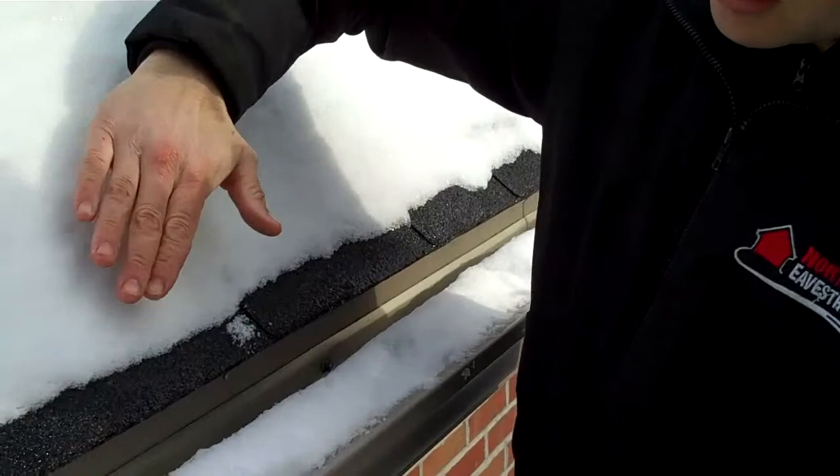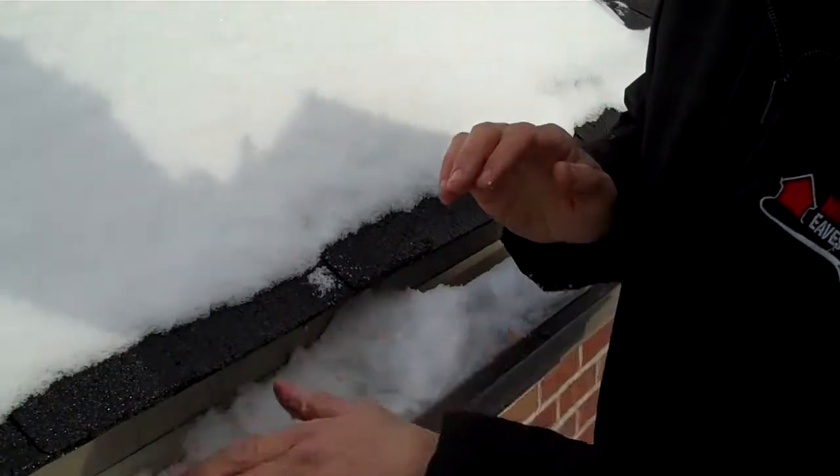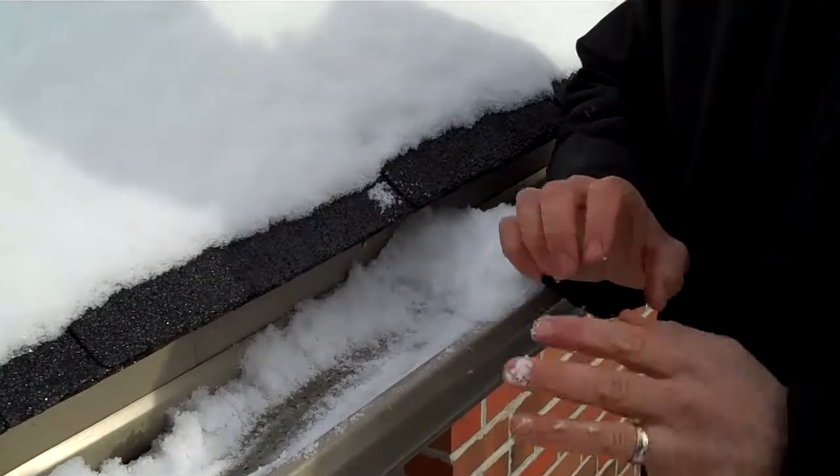What happens is the water comes down out from underneath the warmth under this bank of snow, lands on the eaves trough, and then instantly refreezes back to ice. So there's where the problem is. There's no way to make this water flow down the downpipes without some kind of a heat source — like heat tracing through the gutter and the downpipes — or fixing the melting action that's happening from underneath these banks of snow that are depositing on the roofs.